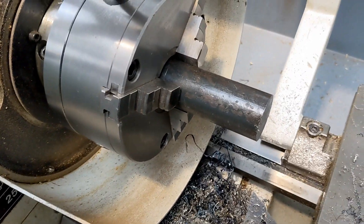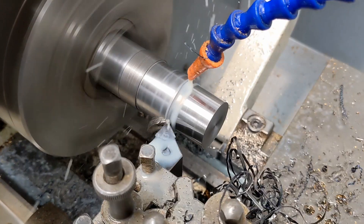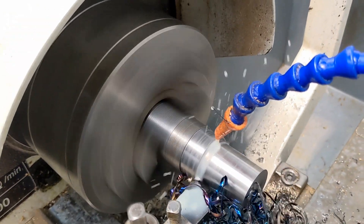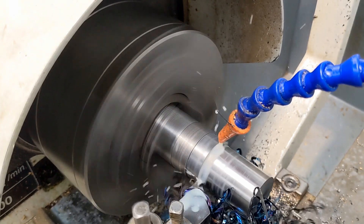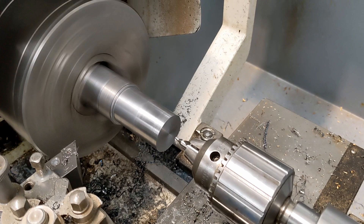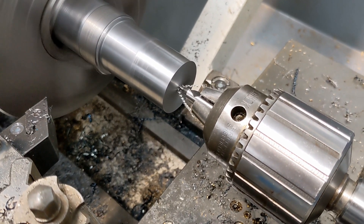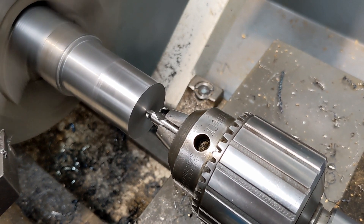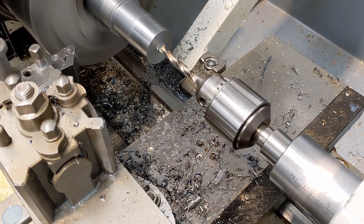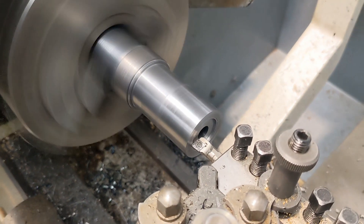To begin with, I used a piece of mild steel to make the bracket. I already measured all the dimensions and had a drawing with me, so I did the rough cut to turn down the part to the specific dimension. The first task was to make a cap for the thrust bearing, so I center-drilled the bar and used a step-drill bit to make around a 10 millimeter hole at the center of the bar.